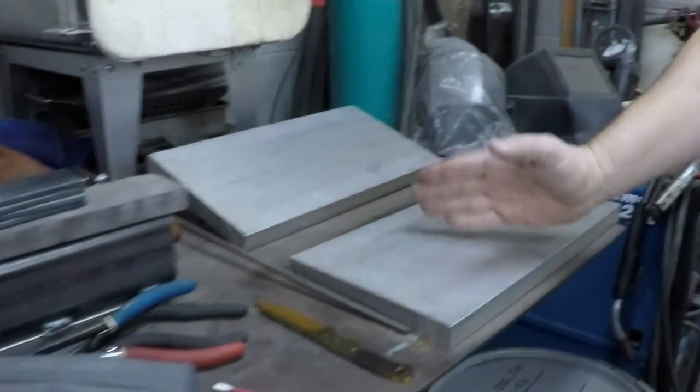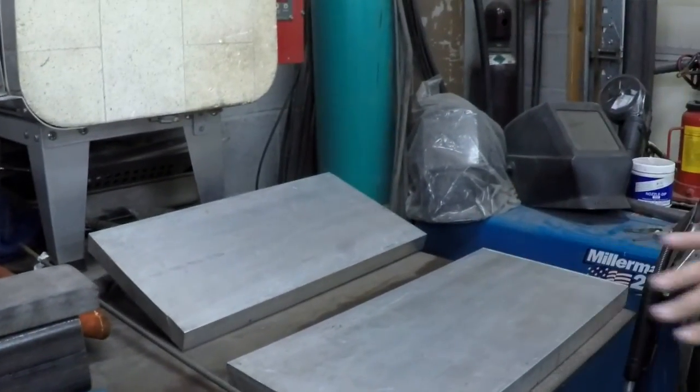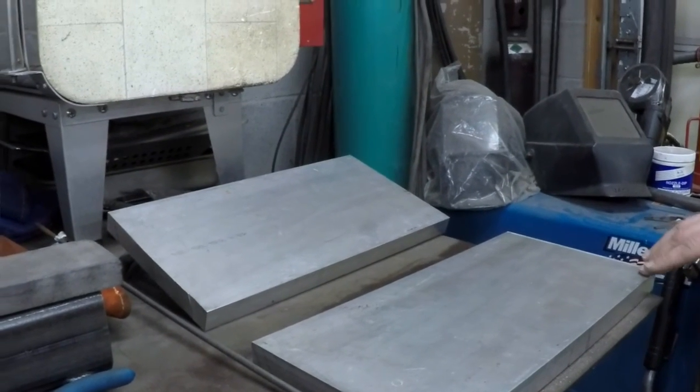After it sits there for about 30 to 45 minutes, depending on the thickness of the steel, I open it up, take the pliers, pull them out, and stack them on these cold aluminum plates and lay one on top of it. It's called quenching. What that does is it jerks the temperature out very fast. And the quicker it cools, the harder it makes the metal. So that's where you get the hardness on the metal.